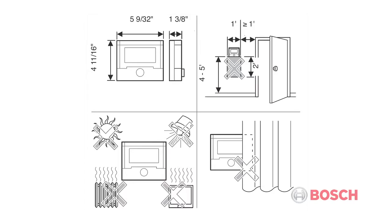The accuracy of the FW200 is dependent upon the installation location. Any radiator in the same room as the FW200 should not have a thermostatic radiator valve fitted to it. The FW200 should be installed so that the overall temperature of the property is monitored, for example, hallways or stairway landings, and not be installed in a room with supplementary heating.